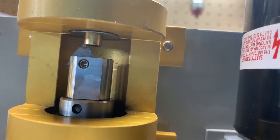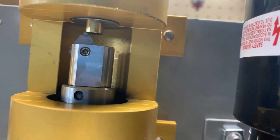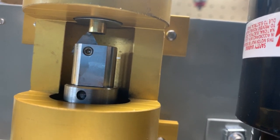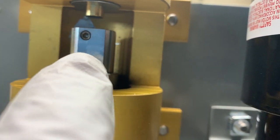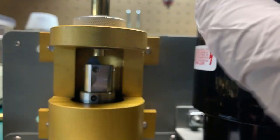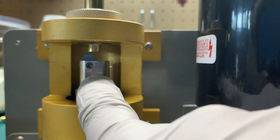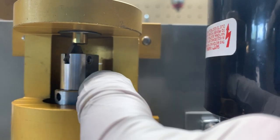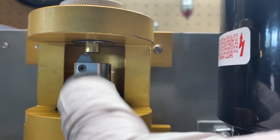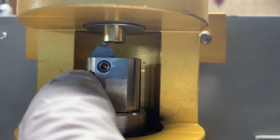Most people are going to trim right after resizing. I know a few guys who do it after expanding the neck — either way, you want to make sure you're always trimming at the same diameter so you can leave this set. He sells extra cutting heads too, so if you're doing multiple calibers you simply replace the collet up here, unscrew this cutting unit, screw in the new cutting unit, and all your cutting dimensions are saved.